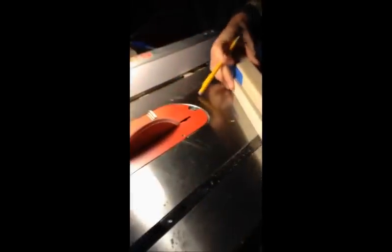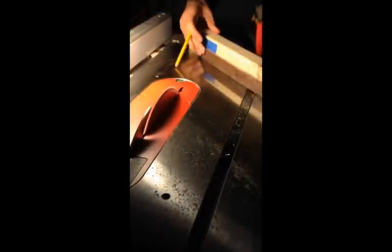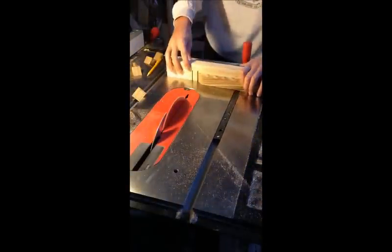With the glue fully dried, I can move over to the table saw and cut these pieces out at a 45-degree angle. These cuts will later be paired up with each other to make the triangle pattern that is seen on the bowl. A complementary zebra wood piece is also being cut to form the full segment.